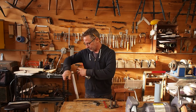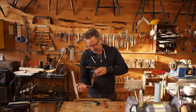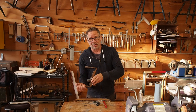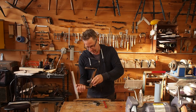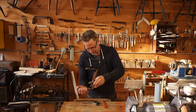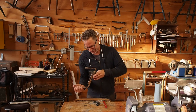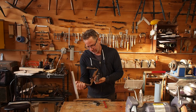I'll put a little oil on here. Then just like I was using my fingers before, I lock up against the back, tip it forward, and use this now to polish that edge. The diamond works through motion, not pressure. So I want to be light in my pressure and create a lot of motion so that it gives me a nice fine scratch pattern on this edge. I basically do this until I find a little tiny burr on the flip side. Once I've got a burr, I put it to the other side of the little bumpers. This side is still a little rough because of the rust on the face, but it's still going to do a fine job. I go until that burr is gone and has flipped back to the very front.